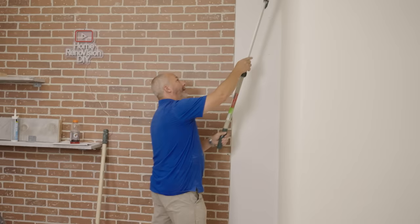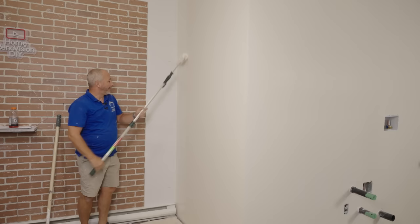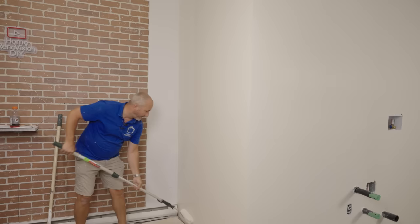Now, if you're in a place where you're doing baseboards as well, you can either attach them after you're done with adhesive, make sure they're pre-painted, and then add a little bit of siliconized caulk at the end. That way you can avoid having to paint it on the brand new wall. Or you can install them while you're in between coats and the paint's drying.